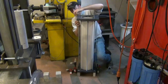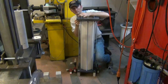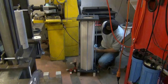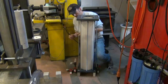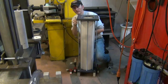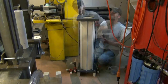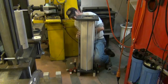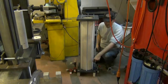We're all in place. Now I'm going to go around, take these lock nuts so they don't move around. And all I do to accomplish that is I just hang on to the threaded rod lightly with a pair of ordinary pliers. Just give it a slight tightening up there. I don't want to preload this plastic too much because I don't want to induce a lot of stress between these 2 nuts. But I'm going to go around them and do the whole thing. Got one of those tight. Now keep the threaded rod from spinning on me when I'm trying to tighten it down here.